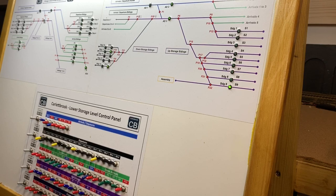One of the big mistakes I made, to pass on, was that I presumed I'd done my wiring incorrectly. So I started thinking, oh, I must have put a wire up wrong, tracing the wiring through, only to realize that it was a bad soldered joint. So the lesson learned there is that when you plan things out, yes, doubt, but also trust in your own ability that you have actually said that A goes to B, and therefore it could be that it's a bad connection. It's not that you've made a horrendous mistake.